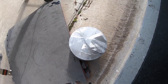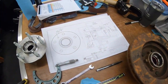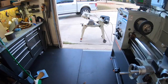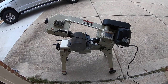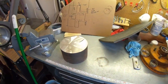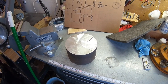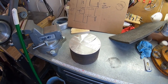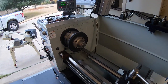One more to go. The customer brought over the Camaro hub, so we can compare - we're making a hybrid of these two. Verified some measurements, everything looks good. The second piece is just started in the bandsaw, so that's going to be a couple more hours. Now it's time to get this big piece in the four-jaw chuck, get that center drilled, face it off, turn it around, lock it back in the chuck, and start hogging off some material.